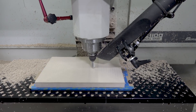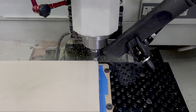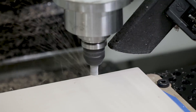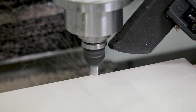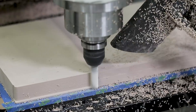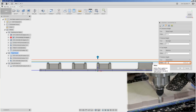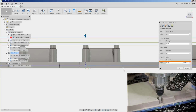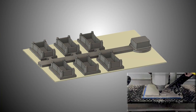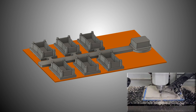So I think we're going to pick one of those up for some future projects. Now we're coming in with our 3D adaptive to do the majority of the material removal — same speeds and feeds. The important thing we're doing is under the third tab for heights, we have our bottom height set as 0.1 inches above the bottom of our part, shown by the blue line. That ensures full superglue contact across the whole surface area of the stock as we go through this adaptive operation.